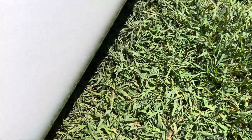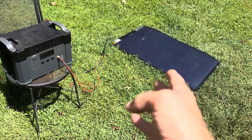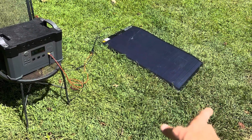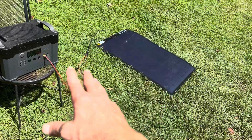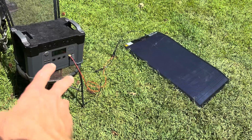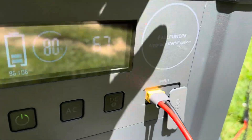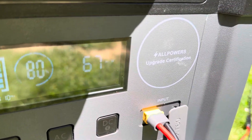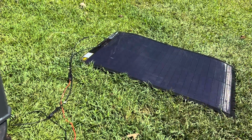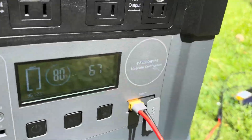Give you another shot of those ringlets where you fasten your screws down, and the back of the panel is just wiped. First test — what this thing is catered for: being lightweight. Actual weight just on the panel is 3.46 pounds. On a portable power station in a camping application, it's just laying flat in the grass, not angle-optimized at all. Let's see what it's making — 67, 68 watts just laying right there flat on the ground. The sun is sitting way back at an angle because we're coming into autumn of the year, so that's not even optimized angle. Not too bad to start with.